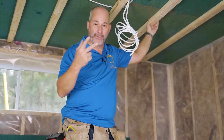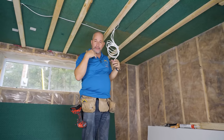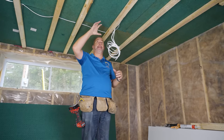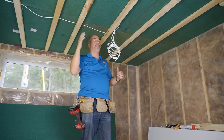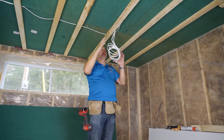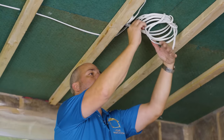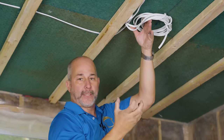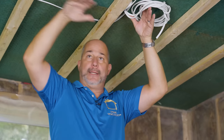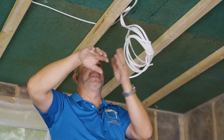When it comes to lighting in a theater room you've got two options. You can use wall sconces, where you can have a box, putty-pad it, and it's a pretty decent seal. For the ceiling, if you want pot lights there are two ways: you can create a five-sided box of green board that your pot light cuts into, or you can install your green board nice and tight, run another layer of strapping with two-by-threes, staple your wiring on the side, drill your hole, wire your device box, and install your pot light without breaking through your sound barrier.